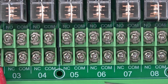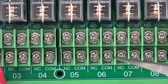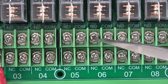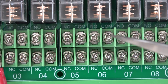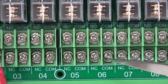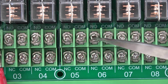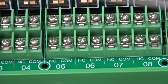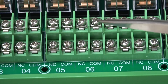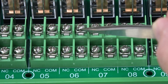For example, you can see channel 6 of the relay output. This is COM and this is COM — the two COMs are connected together. This is normal open and this is normal close. So you can use this COM with normal close and normal open. There are two terminals — a high and a low — making it easy to connect with the V1.